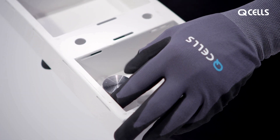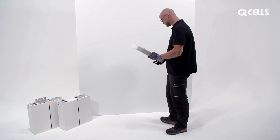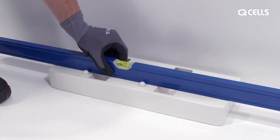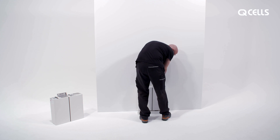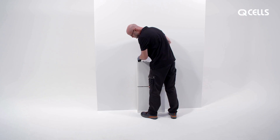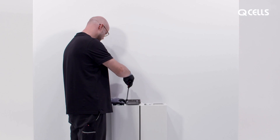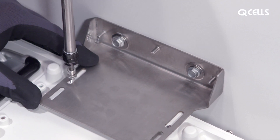Installing the battery, BMS and wall mount. The mounting base can be aligned by adjusting the knobs on the inside — this is only necessary if the floor is not level. Check this with the spirit level. The batteries are then placed on the mounting base and stacked on top of each other. Position the wall mount and fix it to the wall. To connect the upper battery to the wall, use the openings closest to the wall. You are free to determine the distance to the wall.